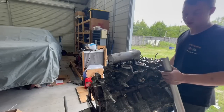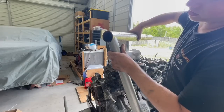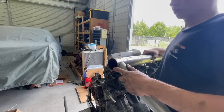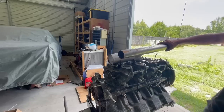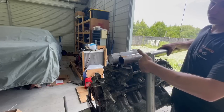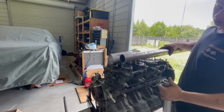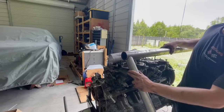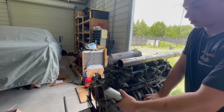So this is the pipe I just cut - I cut it at two and a half inches. You're going to see how it fits. After we get all these cut, we'll trace them, use a two-inch hole saw - that's the diameter of this - cut it out, stick that on there, and perimeter weld all the way around so it doesn't leak. Eight more of these - each tube is just going to literally stick like that. We just need to measure how high up we want it, and have an injector on each one. Probably about two, three inches.